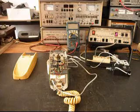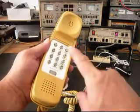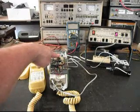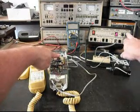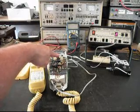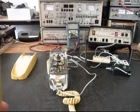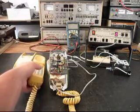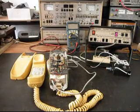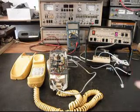We dial through our numbers and transmit into the handset — one, two, three, four, five, six — hello. So we know that this telephone has receive, transmit, and that it's dialing out. We also want to check the ring cycle, so we go ahead and hang the telephone up and ring it, then bring back dial tone. So we know that this telephone is finished up basically, and what we'll do is take a short break, put everything back together again, and do our final checks.